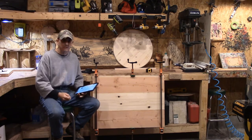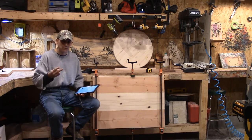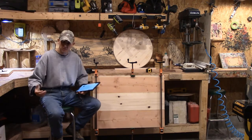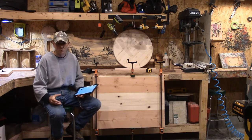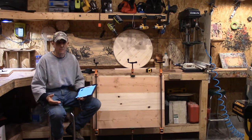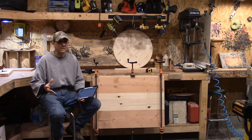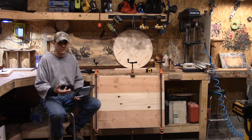The project itself is going to be very simple to fabricate. We are going to build it kind of around the idea of my kitchen table — it will be an oval top, two-player track. We are going to opt for quarter-inch holes; I'm not going to go with eighth-inch holes on the table — I think it would look a little ridiculous. So we are going to go with larger pegs. We are going to show you step by step in VCarve Pro how to go in and lay your track out. We've done other cribbage boards before, so it's basically going to be the same, except your peg holes are larger and you're no longer a board — you're a physical table.